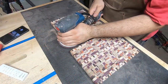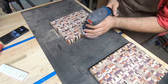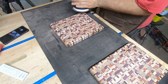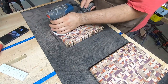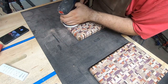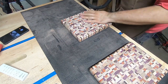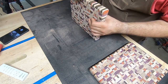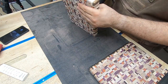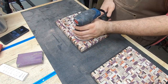Anyone who says they love sanding is either lying to you or is crazy. That being said, sanding means you are almost at the very end of your project. I start with 80 grit, then step up until 180 grit. Before using the 180 grit though, I spray both boards with water to raise up the grain. If you sand the end grain to too high of a grit, you risk closing off the end grain. Since the next step is to soak it in mineral oil, you don't want to close the grain off or you won't be able to get the mineral oil into the wood.